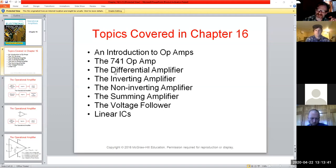If you look on the spec sheet, you'll see they have everything from SOICs, which are the surface mount style, up to the through hole ones with the DIP style, dual inline package, where it's got the teeth where you plug it in. They have the plastic coated style. Then they have the can style, literally the metal ones, and that one's the workhorse. So you expect a lot of heat, where it's made to be mounted on heat sinks and whatnot. So it has a lot of ranges to it. It can do quite a bit.